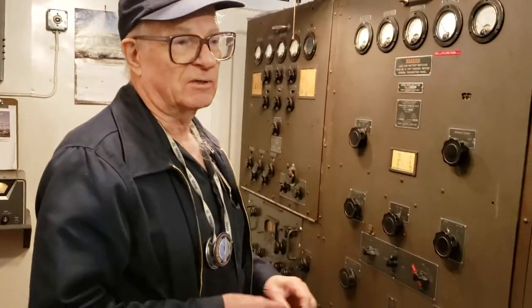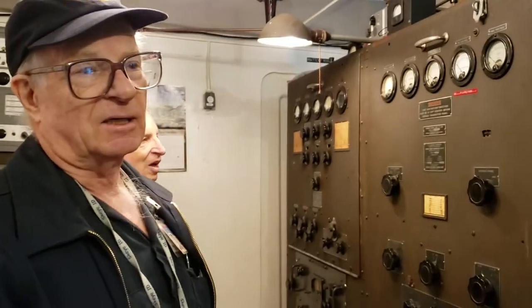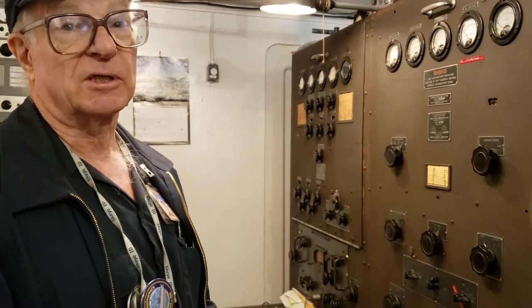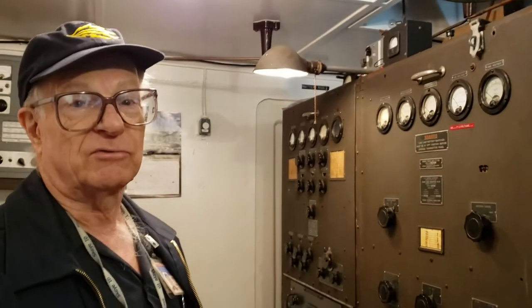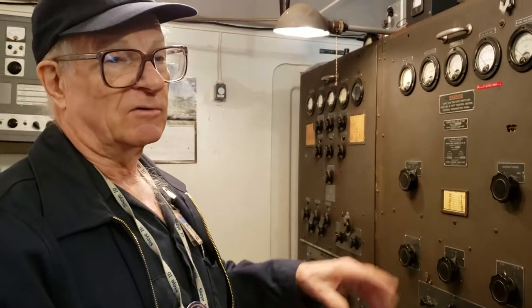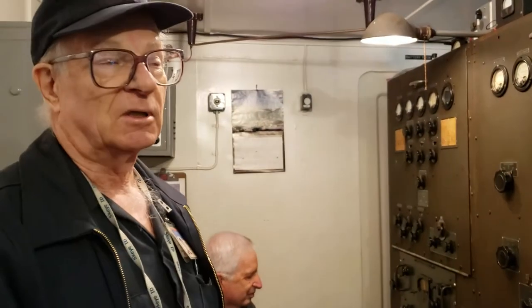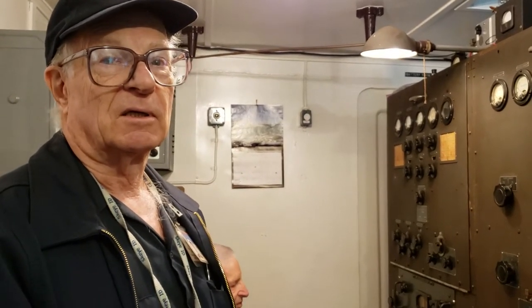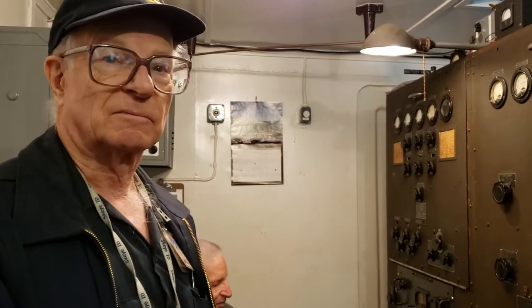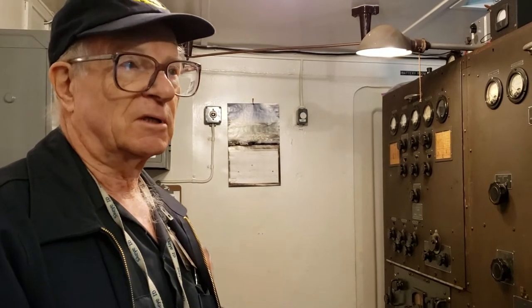So when the ship was built, there was like 800 watts of AC on board from a converter. That was for this receiver, the depth sounder, and a couple other instruments that were AC only. Everything else was DC. Well, how many volts did they operate on? 120-240, so 120 for the low power stuff, and then a lot of the big motors, deck winches and things were 240. So they had a DC generator on board? Yes, two DC generators. And did they use batteries on that line? No, it's just straight DC generator.